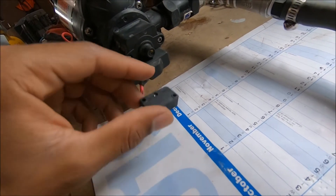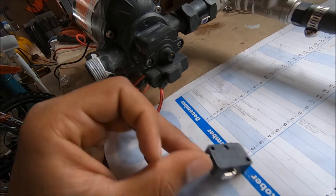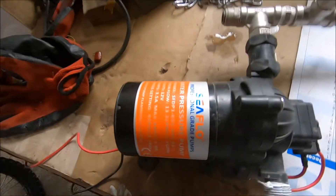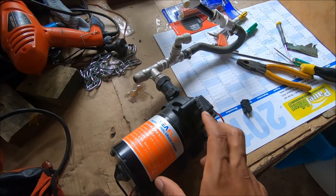The contacts were arcing, so the best fix is just to replace the switch. That's what I've done here — the switch just sits in here. Replace that switch and you should be good to go. This is on a Sea Flow water pump, which I think is just an aftermarket Sure Flow water pump.